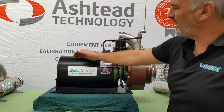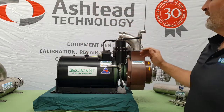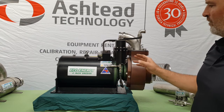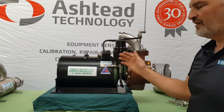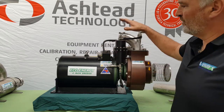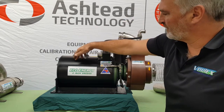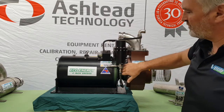Obviously electric motor. This is filled with environmentally friendly biodegradable oil. Same with the coupling. Now we're pretty particular about avoiding leaks even though it's environmentally friendly — we don't want anything leaking. So we've got two separate compensator systems on this setup: one dedicated to the motor itself and the other dedicated to the shaft seal system.